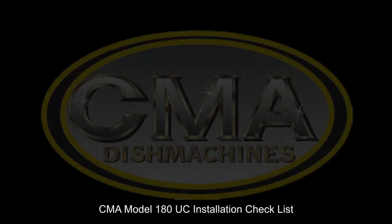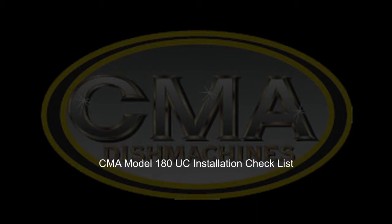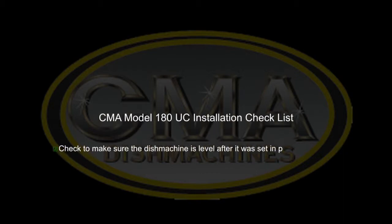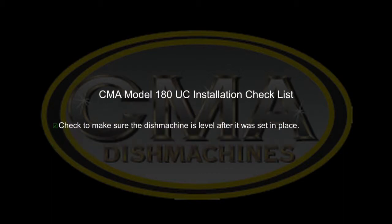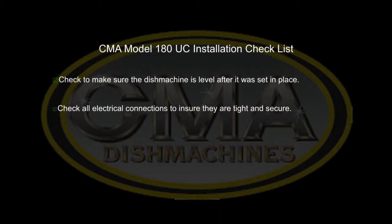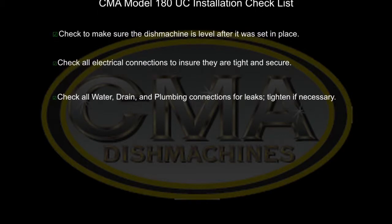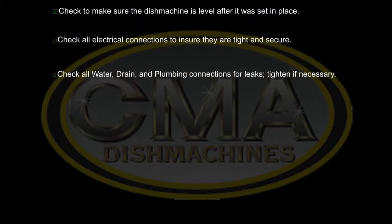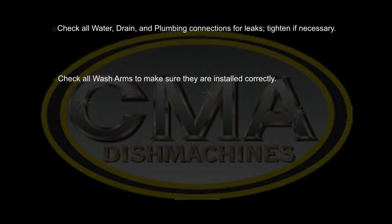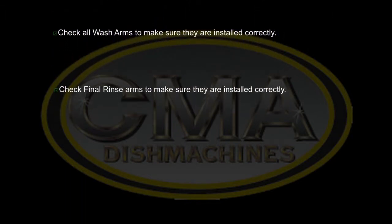Now that the Model 180UC has been installed and is fully connected to both water and power, it is time to go over the final installation checklist. Check to make sure the dish machine is level after it was set in place. Check all electrical connections to ensure they are tight and secure. Check all water, drain, plumbing connections for leaks and tighten if necessary. Check all wash arms to make sure they are installed correctly. Check final rinse arms to make sure they have also been installed and tightened correctly.